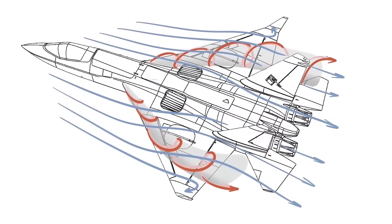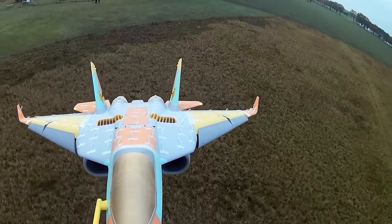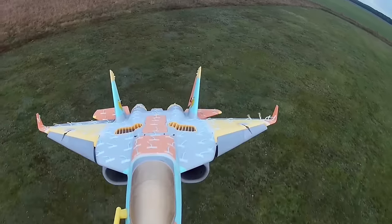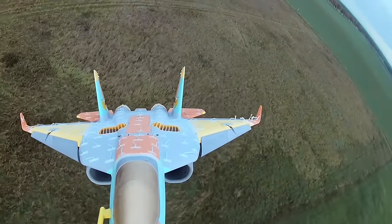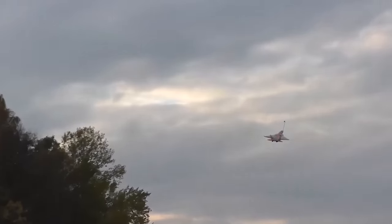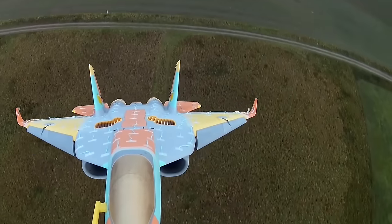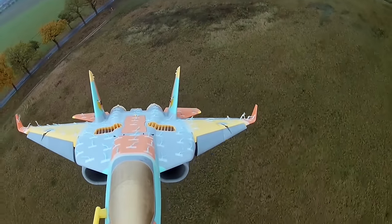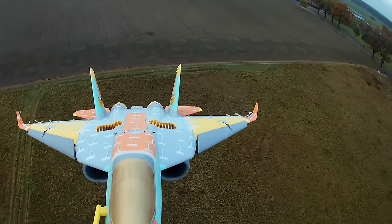This picture shows off what would happen without the strakes in front of the wing. A delta wing itself provides a vortex, which helps to gain the lift on low airspeed. But with just one vortex, there is just half of the energy. And to make this as safe as possible, minimum airspeed with good natured characteristics is super important. Here on the first landing with retracted droop nose, the landing speed was relatively high. And after some acrobatics, we want to check out the absolutely minimum possible airspeed.